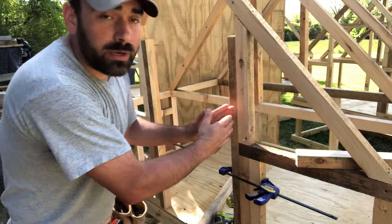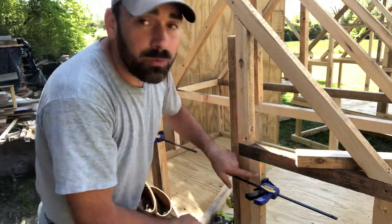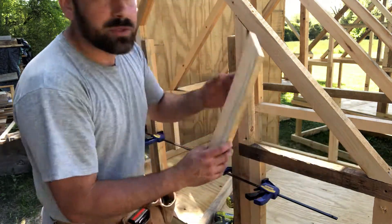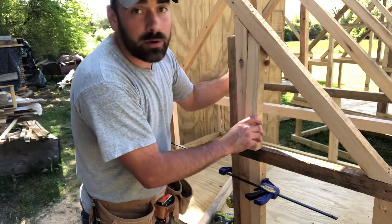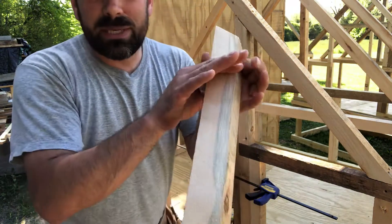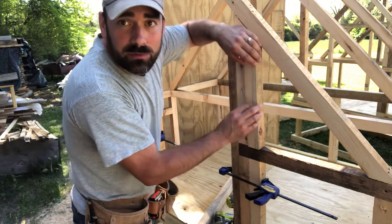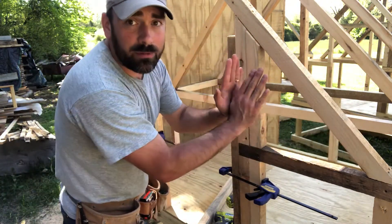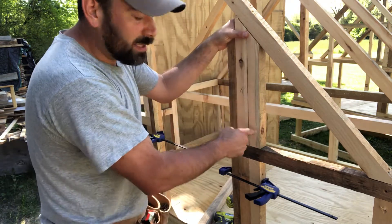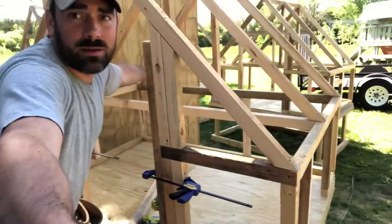Remember that we're going to have a piece of sheeting coming in through here that's going to be 48 inches. We added this little piece onto here so it would catch that 48-inch sheet. I've already pre-cut another one of these. It doesn't have to fit like a glove - it just has to be enough to catch some of the overlap of the two sheets coming together. On this wall and on the opposite wall we're going to have to do the same thing.